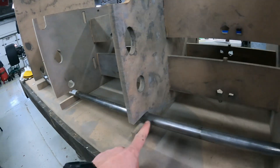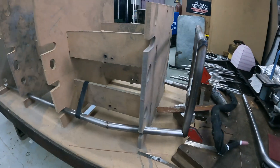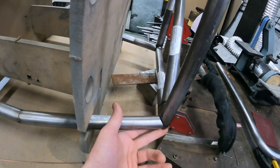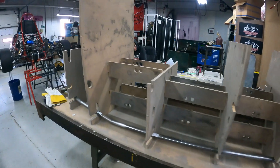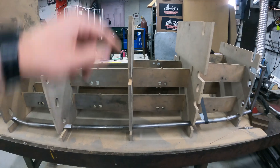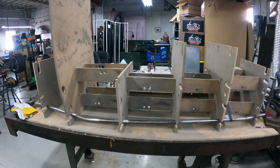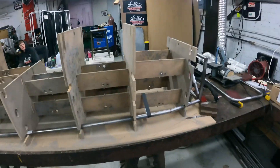There are the notches for the tubes. We line this up to make sure that it all does work — the copes line up on that side and this side. So now we're going to go ahead and put in the main roll hoop and the front roll hoop, do our side impact structure, see if that all lines up, and then we'll do the back part and the front part.